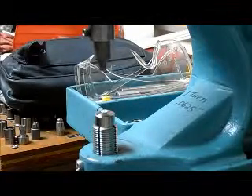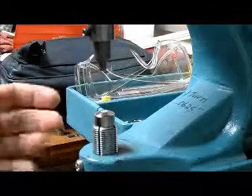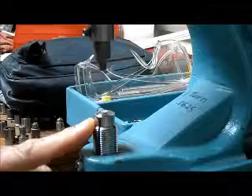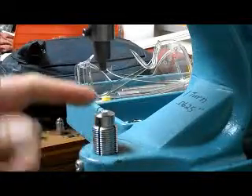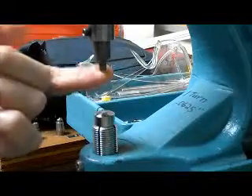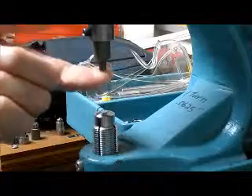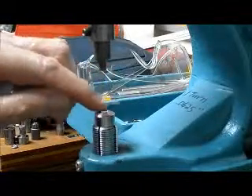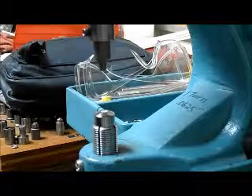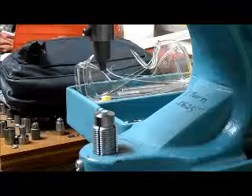The purpose of this video is to illustrate how the dot dinking tools function. The tools consist of a lower die with a hole in the spherical radius, and the upper tool is a punch with the spherical radius on the end. The whole principle is that the spherical radius will capture or pinch the material against the edge of the hole on the lower die. It's a very efficient way of cutting with a minimal amount of pressure.